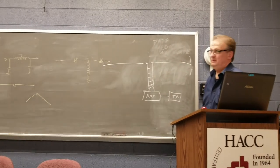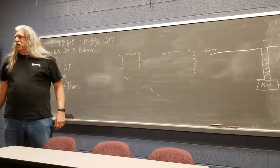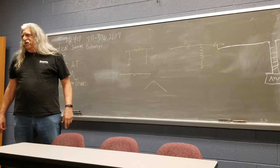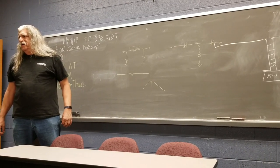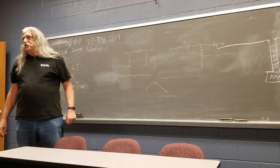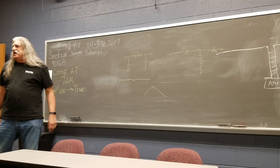Well, there are some frequencies that ladder line will null at. I mean, no, it's not the frequency, it's the voltage. Yeah, the voltage, right. And so some people say more than 42 feet, then you won't have a problem. 42 feet per leg? Ladder line. Oh, ladder line, that's correct. It does take it up, yeah.